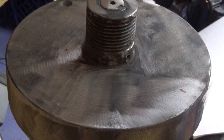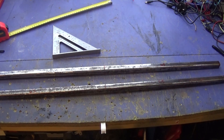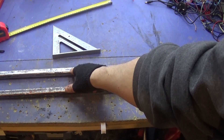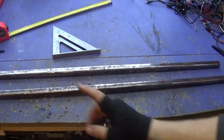I've gone over the marks with a sharpie to make it easier and I'm connecting the dots so I know where to put the arms. I've done some preliminary measurements — three pieces at 45 and one at 150mm which I'm going to cut into 50mm sections. Sadly I've lost a lot of footage of cutting and welding, but the arms are now welded to the pulley and I'm adding a few bits and bobs.